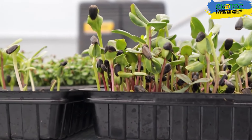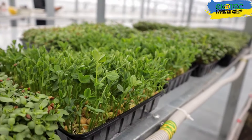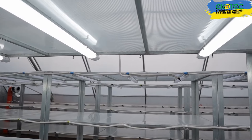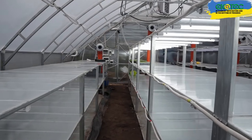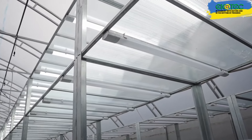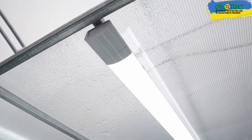There's a shelving system for growing plants here. We'll grow microgreens, salads, and other things here. The advantage of the shelving system is that we can get more usable space in a smaller area. This greenhouse is about 280 square meters — 10 by 28 meters — but thanks to the shelves, the usable area has increased to 530 square meters. With a smaller area, we need less heat to heat the greenhouse. We have a 95 kW boiler installed here, but if we took the entire 530 square meters, we would need a 150 kW boiler — almost twice as much heat. Therefore, due to the compactness and the shelving system for growing salads, greens, and microgreens, we can save on heating due to a smaller heating volume.